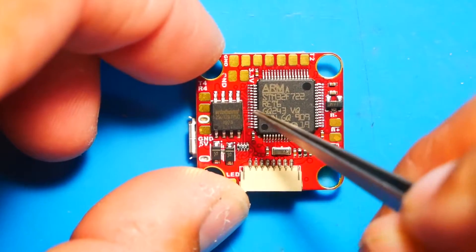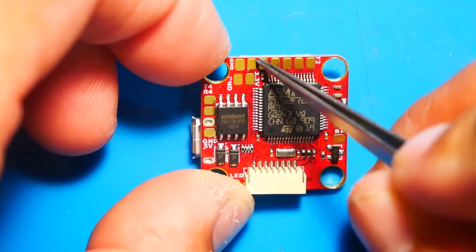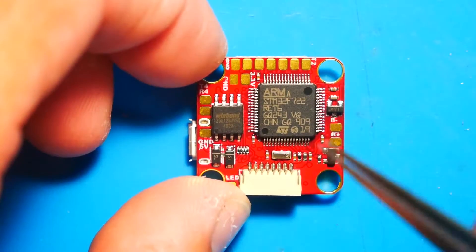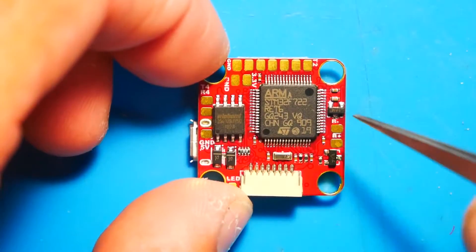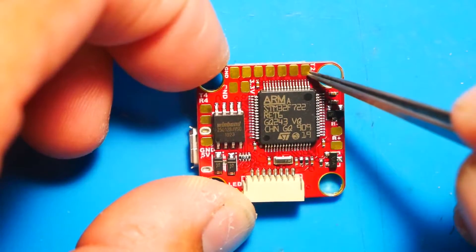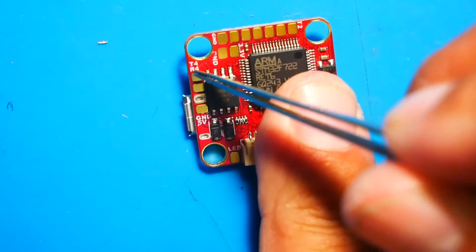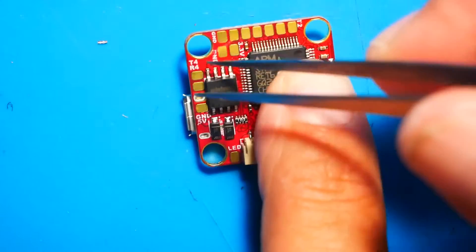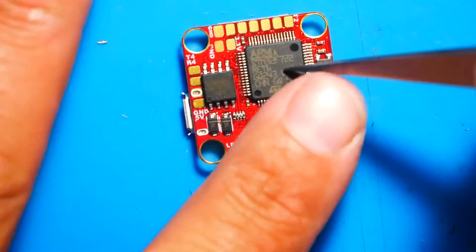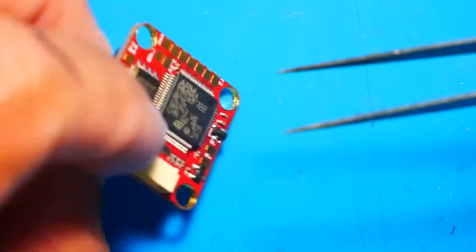Let's go over a quick pinout. On the back you've got ground and 3.3V if you're running Spektrum or need to do any testing. You've got ground, 5V, RX6 and TX6. You've got 5 full UARTs, meaning TX and RX for 5 full UARTs - you're never going to run out of options. You've got camera control and another UART with TX2 and RX2, an LED pad in the corner, a 5V and ground, and then TX4 and RX4 - a good spot to run your receiver. Because it's an F7, you do not have to run an S.Bus - it'll invert the signal all by itself.